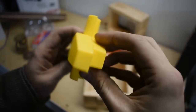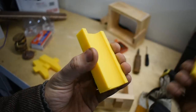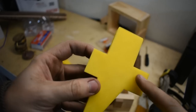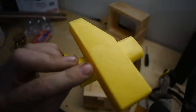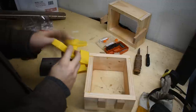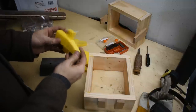You can see I printed it with draft on all the faces so I'll be able to get this out of the sand easily. This handle thing - I'm going to be using a core for that. Basically you stick them together, stuff it full of your core material, and when you lift off you have your core. You ram these up in the sand, remove this, and you have a handle-shaped hole. You stick the core in that hole, and when you cast you'll get the shape of the hammerhead with a hole through the middle. You gouge out all the sand and boom - hammerhead. Because I cannot drill through aluminum bronze - too hard. Another important casting feature: these edges are all rounded slightly. That's something you usually do in patterns, the outside and inside edges also. I can do it in the modeling program and then just print it.